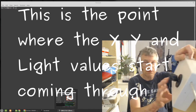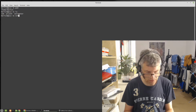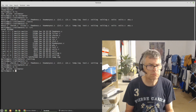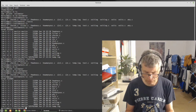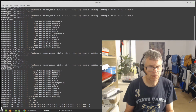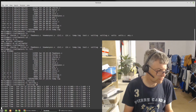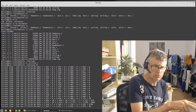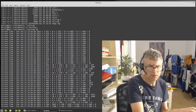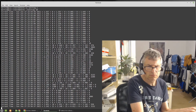I also need to kind of de-average the readings. So as the thing scans around, it's obviously going to be seeing a spot and then moving across. So from the very, very average data that's coming in, I must be able to actually calculate a more zoomed in view of the world. Because the sensor's collecting data over such a large area, but I know if it moves very slightly, I should be able to work out the difference between what it saw just now and what it saw then.